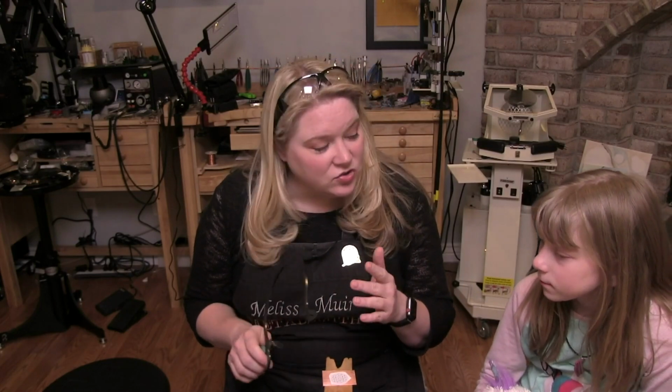It's kind of interesting with saw blades, because let's say that we have a 0 point right here, and then there's a whole bunch of blades that go on this side and a whole bunch that go on this side. If we start at 0 and move to the right, we only have one 0. That would be a 1/0. As we move to the right more, there's two 0s. So it's a 2/0, 3/0, 4/0, 5/0, all the way out to 10/0. Now that means that there are 10 zeros.